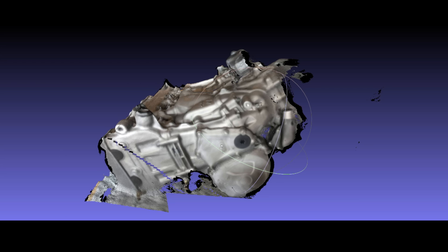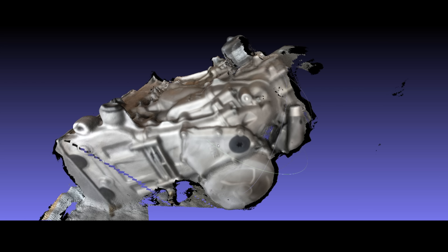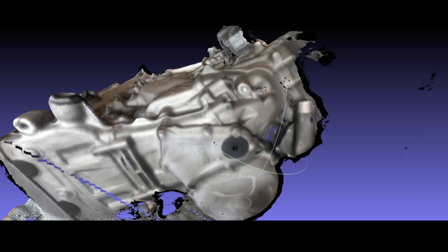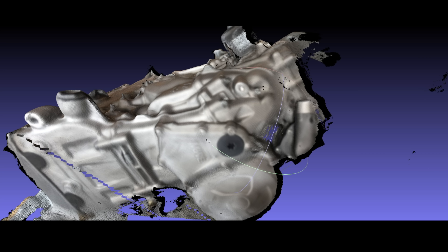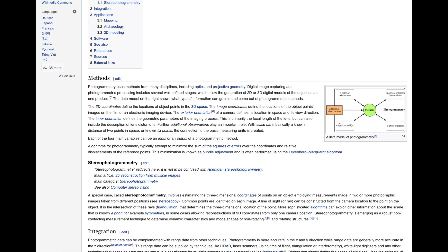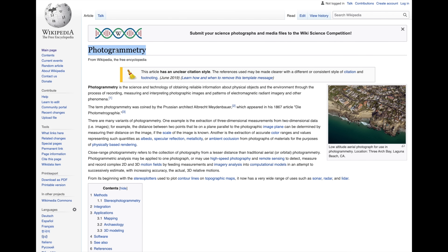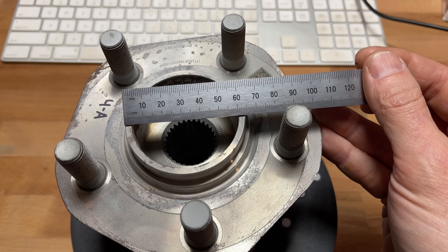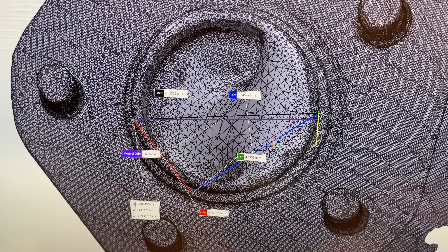The data from the front sensor is good, but you have to scan very slowly and make sure to go over the important areas carefully. The scans will pick up background surfaces without much confidence, so you end up with lots of garbage data if you're not careful. Some of you are wondering about using the camera on your phone and not the LiDAR — this is called photogrammetry. The problem with this approach is that it's hard to scale things correctly, and if you're only off by 2% or 3%, all your important geometry might be too far off for your use case.